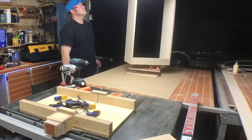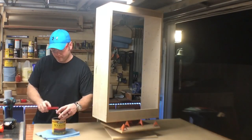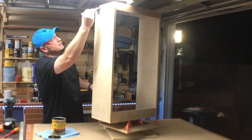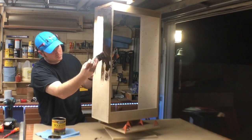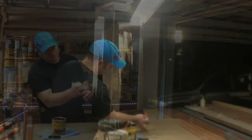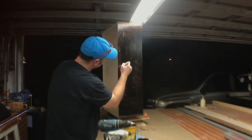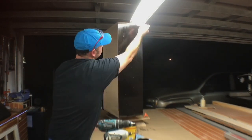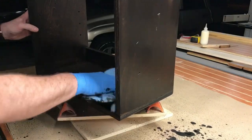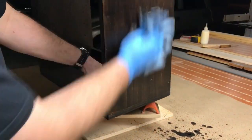A piece of craft paper is what I need now. I'm going to start applying some stain. I made this little lazy Susan painter's triangle thing — I love it. You can spin pieces of wood, stain doesn't stick to it, and it works out great. I'm using a dark stain here; dark stain typically works best when I've decided to distress a new piece of wood. Once you put that dark stain on, you really start to see those imperfections come to life. Once all the stain is applied with the brush, I come back with a shop towel and take off the excess.